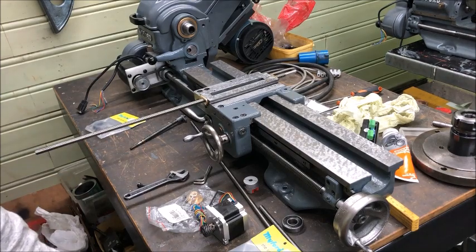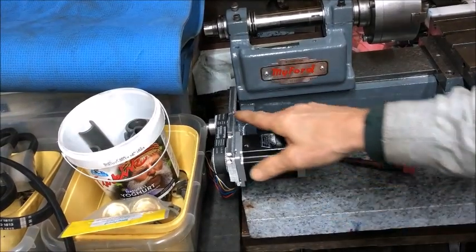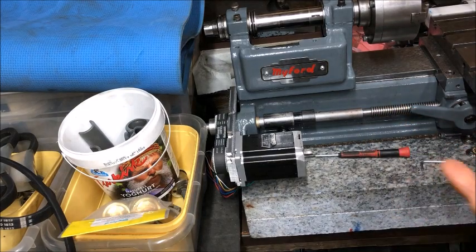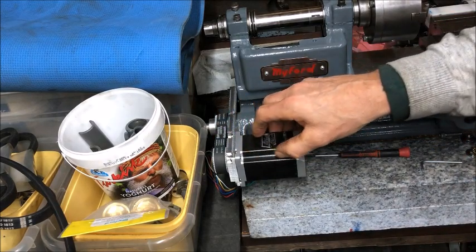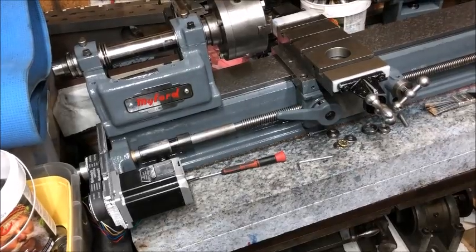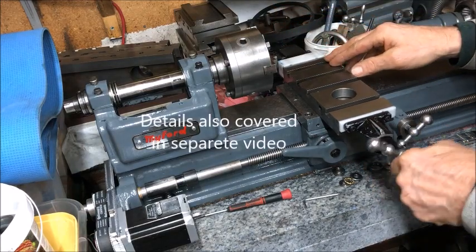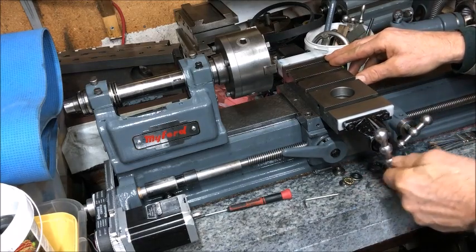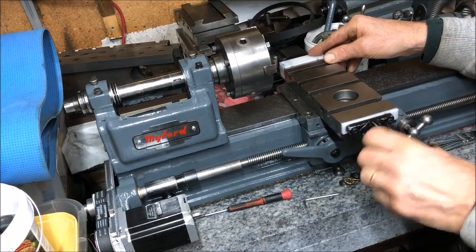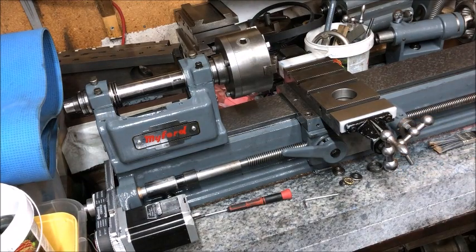On my ML10 we can go over there as well. There's a different version where I have the stepper motor mounted to drive the end of the lead screw. It's not necessary to have it exactly that way, but that's the way I chose. For the cross axis I opted to use this integral motor lead screw. I'm not 100% certain I'm happy with it, but it functions — though it makes it non-detachable. I might end up redoing that after I've seen how it functions. Otherwise, plain sailing.